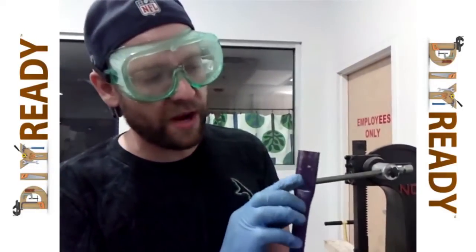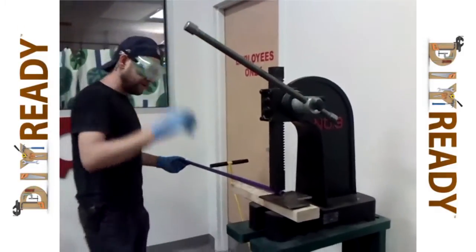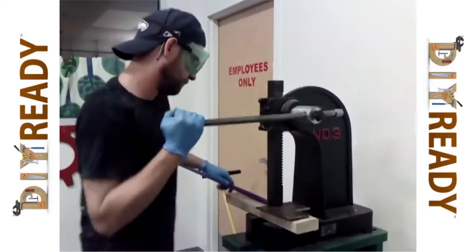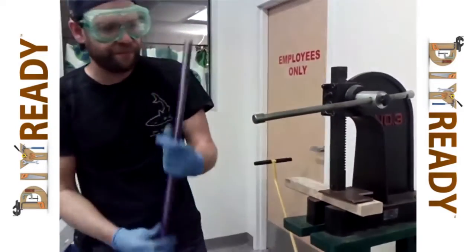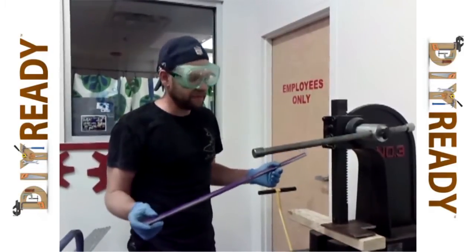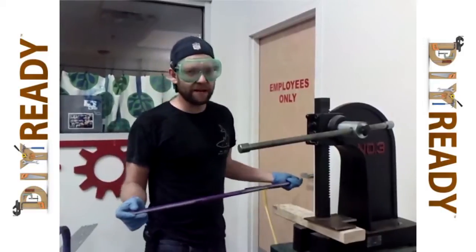We want a nice, clean, rounded edge — no jagged parts sticking out — that destroys the integrity of the steel. You've got to make sure your angles stay the same, so keep it flat because you're crushing the other end at the same angle coming across. The great thing about making a geodesic dome out of this pipe is it's really forgiving. Your cuts want to be within a tenth of an inch, and your angles within probably a degree. But when you start bolting it together, it flexes on its own as you tighten it up and takes its own shape. I've yet to have done one that turned out wrong, and some of my measurements were questionable.